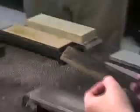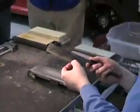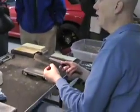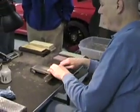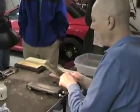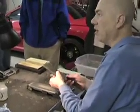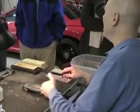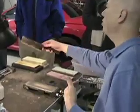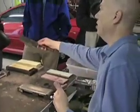But both of these have actually been hollow ground and then finished on flat water stones. This feels flat to you guys, but it's not. If you put it on a stone and click up on that angle and just slide it down there, you'll see that the top here and the bottom of the iron cladding is the part that's actually hitting the stone, because it's been hollowed out. It's a stone that's minimum 3 foot in diameter. In some cases they go up to 6 foot.